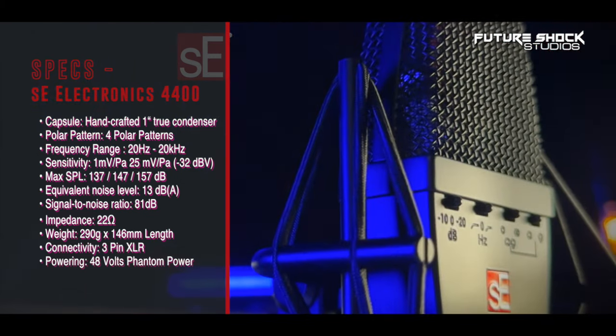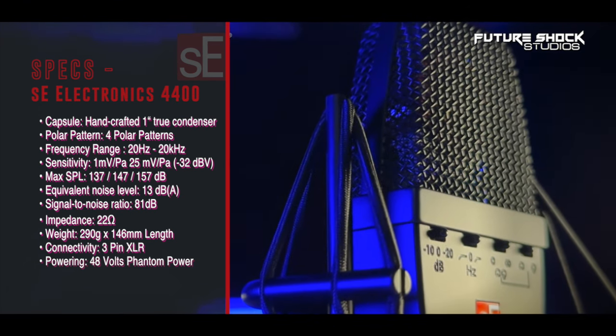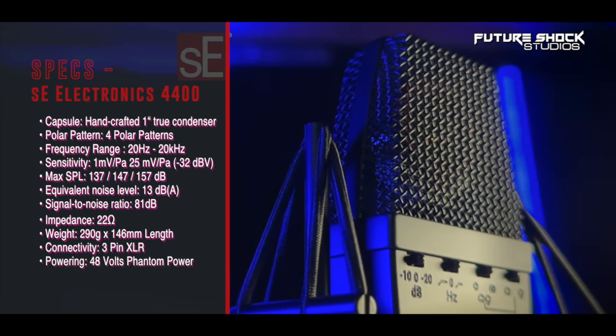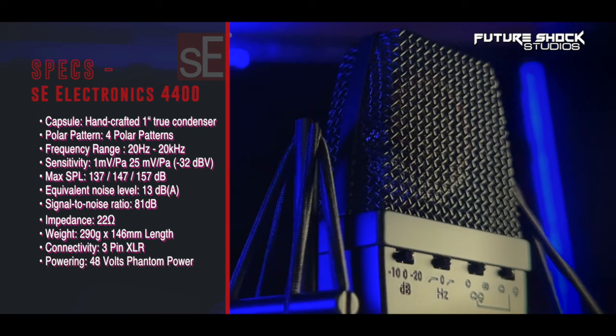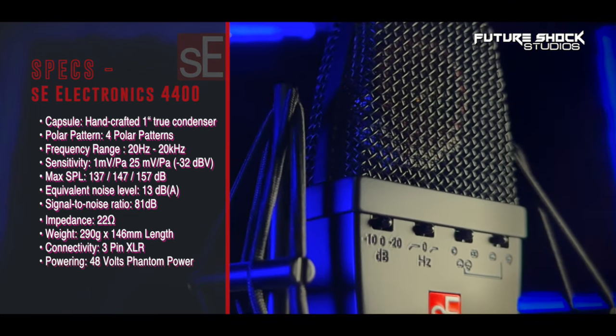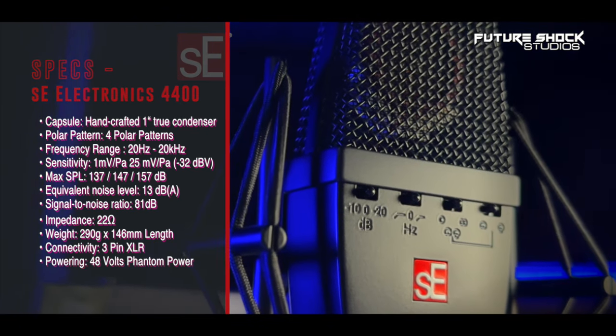The equivalent noise level is 13 dBA. Signal-to-noise ratio is 81 decibels. The electrical impedance is 22 ohms. The microphone comes weighing in at 290 grams with a length of 146 millimeters. Connectivity is a 3-pin male XLR connector, and you will require 48 volts of phantom power to power this microphone.